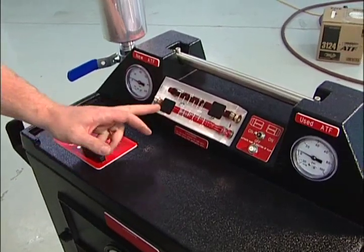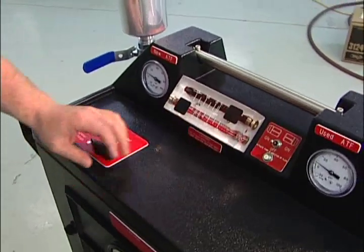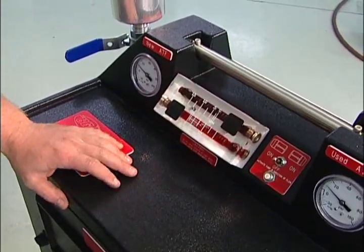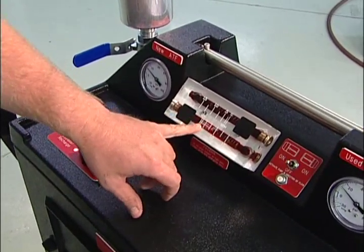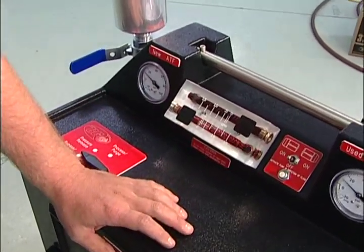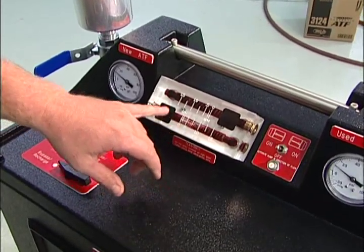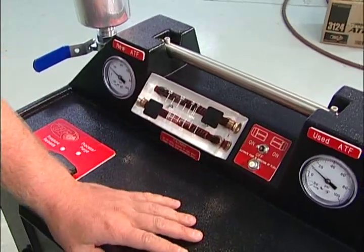As I'm watching, I can see the fluid going from left to right. I can also tell we've got some air bubbles going through the sight glass. We can see one pellet — one bullet — while the other bullet is underneath the black dot. The one that we can see is the direction we go. We can see the bottom one going from left to right, so when we're ready to do the service, we will flip the switch to the right.